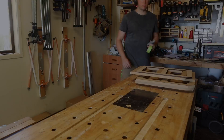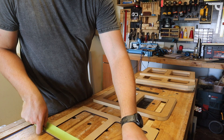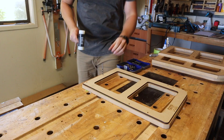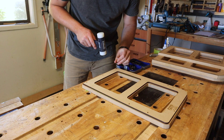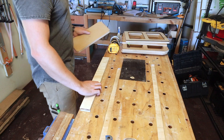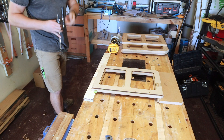The final couple of options have something in common — they both require the reintroduction of the template, some green painter's tape, and some super glue. With super glue applied to one side of the sandwich, we pop the two pieces together and temporarily fix them. Once the template is fixed to the MDF, I'll utilize these pre-made drill holes. You can mark through these with an appropriate drill bit, but I'll be using a spring-loaded punch instead. A couple of bits of scrap elevate the template and material off the workbench, and once we get it all clamped together — I realize I've set it up upside down. Much better.